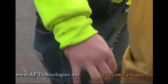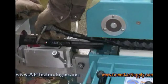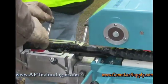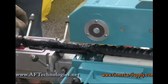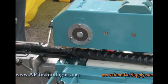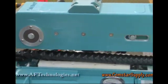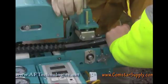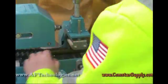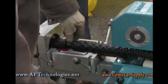The next step is to prep the cable. We'll put a missile on the front end of the cable attached to a swivel, attached to a grip on the fiber. Once we do all these tests, we'll feed the cable to the back of the machine, lower the tracks, turn the air on, get the cable moving — start nice and gently. We'll have to make sure it's coming off the reel at the same time it's going into the blower, and we can control the speed. That's going to be the process.